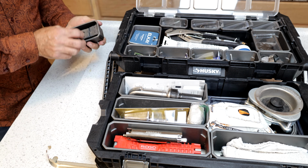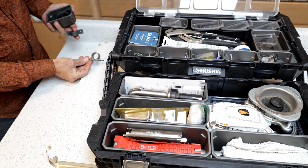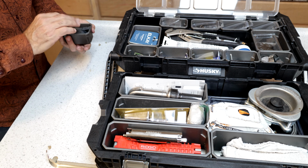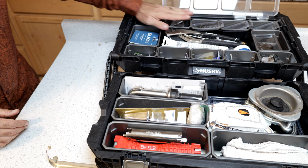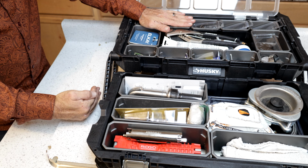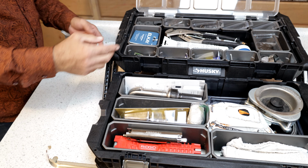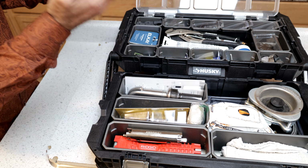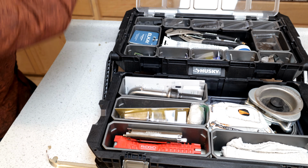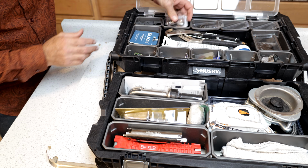I'm going to go ahead and start at the top. What we have here, these clamps right here are for dishwasher lines, if you can see this nice and clear against that background. One of the problems you'll have is that tenants will say that water is pooling in the bottom of their dishwasher, and what's happening is that water is actually pooling up into the sink, and as it's trying to drain down through the garbage disposal, it's going out of the dishwasher drain line all the way down to the dishwasher. So what you want to do is pick that dishwasher drain line all the way up to the top and pin it in place with one of these clamps, and then the water can't go uphill to then make it downhill. Next, we have just a few aerators.